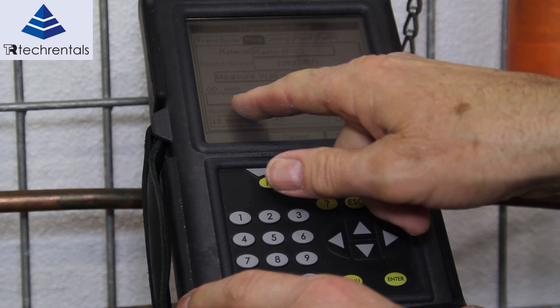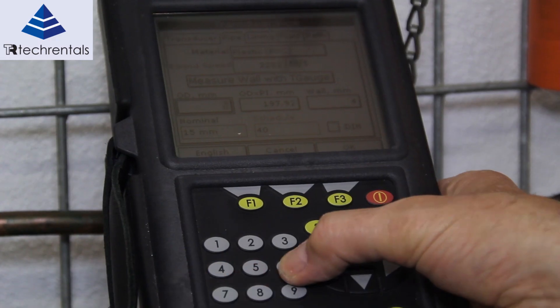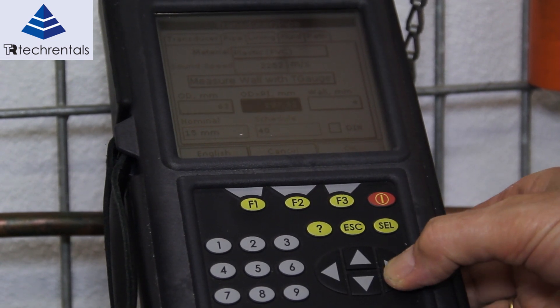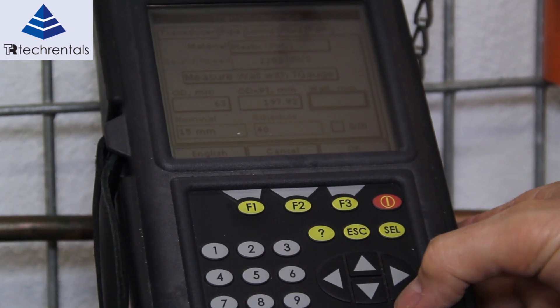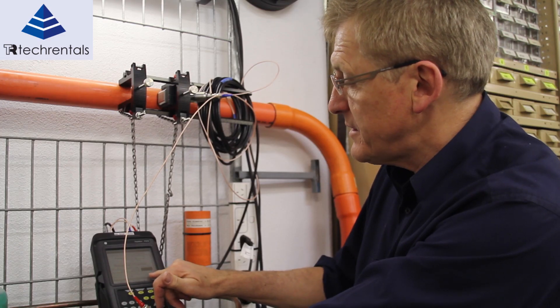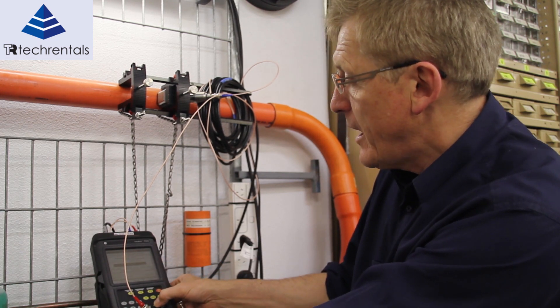The outer diameter of the PVC pipe is 63mm and the wall thickness is 4mm. It gives you the outer diameter times pi so you can confirm the measurement — you'd usually get these out of the tables. If you happen to have a DIN pipe you can select the particular schedule from the bottom, which makes it quite simple.